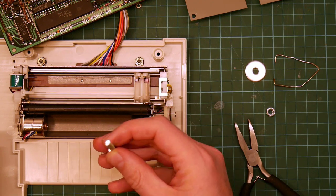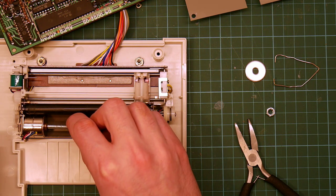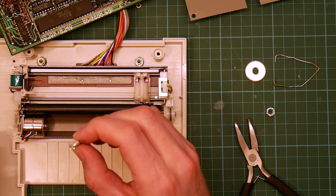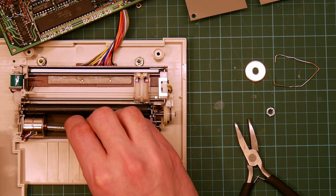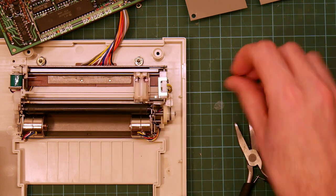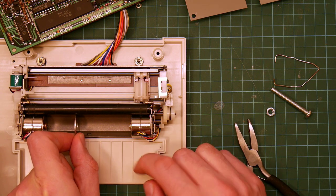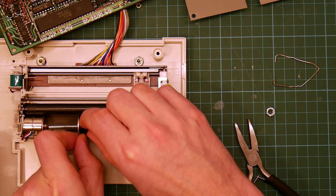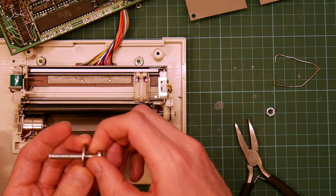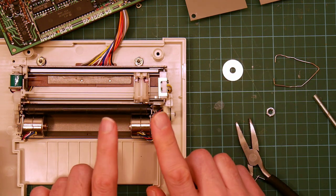I am going to use this bolt. The end of the bolt is slightly concave, so it will very nicely go on the end of the metal shaft. A spot of oil there and I'll end up with a fairly low friction contact surface — it won't slide off and I can adjust the pressure easily enough by moving the bolt in and out. But what's the bolt going to fasten to? The answer is this 20mm washer. I am going to mount this here inside this empty space, and the bolt is going to go into the washer with a nut on the inside so I can adjust the position by rotating it. How am I going to fasten the washer in? Epoxy.